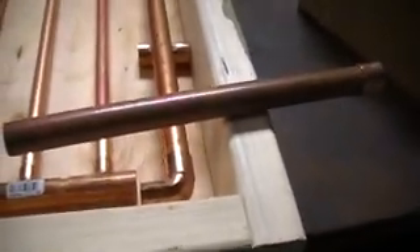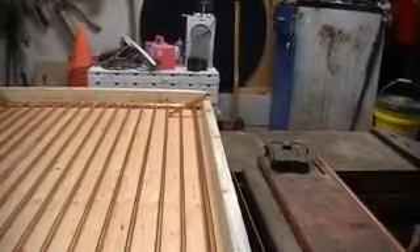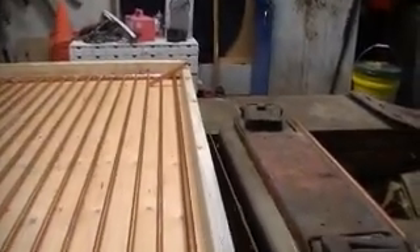I ended up with 16 riser tubes. The reason I have this here is these pipes are going to connect right in here, go through, and they'll be stubbed out and ready for a second collector. You can see there's one up there too. That will be hooked on and slid through a hole, and they will be insulated temporarily until I build another one and connect up to it and continue the series.